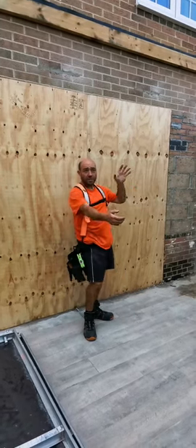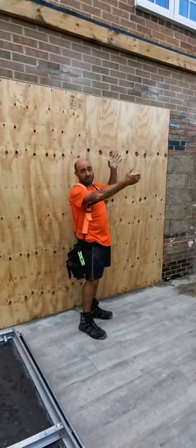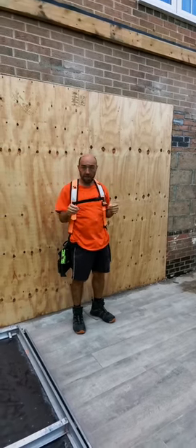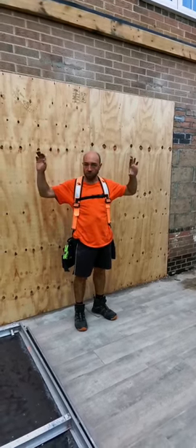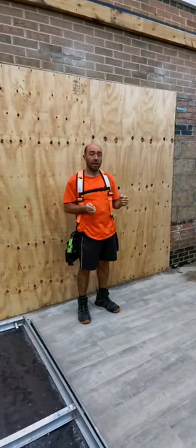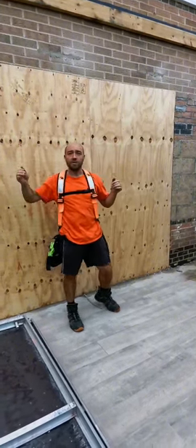When I'm working this out on my own, what I do is I'll get a rafter in place, mark it and go to the other end to see if there's any discrepancy. We're here with 10mm but I don't want it to show on the roof. So I'll just play with it with 5mm rather than measure more individual rafters.